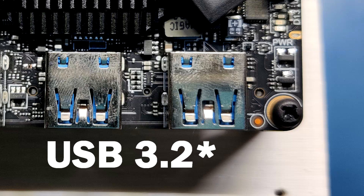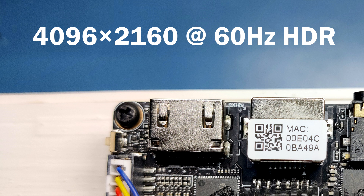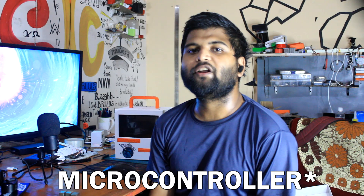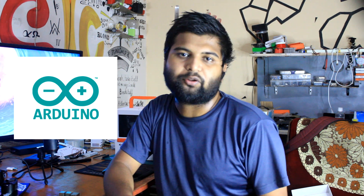As for the I/O, it contains two USB 3.0 Gen 1 ports and one USB Gen 2 port, along with one Type-C port that supports PD and can be used as a USB port or a DisplayPort. It also contains an HDMI port for outputting 4096x2160 video at 60Hz refresh rate. Spec-wise, it surpasses the Raspberry Pi by a lot. It even contains a co-processor, the ATmega32U4, which is the same processor used on the Arduino Micro. We can use the Arduino IDE for controlling it and run all sorts of stuff by connecting modules, sensors, and discrete electronic components to its GPIO pins.